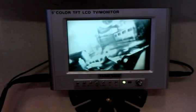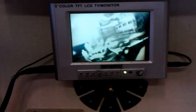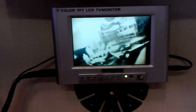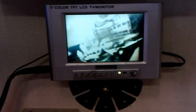All right, and you can see a little green LED on there which indicates that it's in phase, and this relay is connecting the two outputs together here. Just about make it out in the mess. Right, when I touch this wire, I'm going to knock them out of sync, and you'll see on the display very, very tiny, fine pulses, spikes effectively, on the clock side of the slave camera. So what it's doing is it's knocking the clock out repeatedly until the two images are in phase.